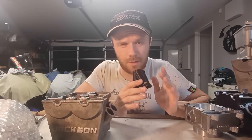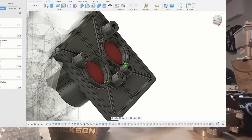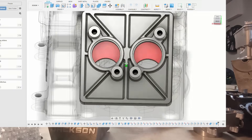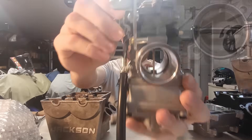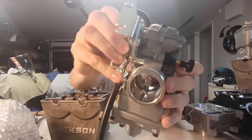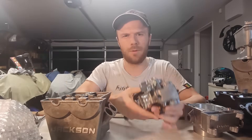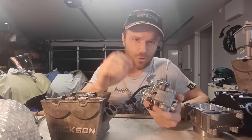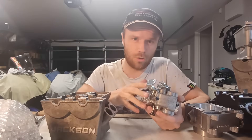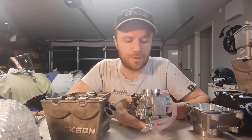While designing this I whipped up a quick design for a guillotine or slide throttle body that would mount straight on with a couple of countersunk bolts. The slide moving up and down would make it completely unobstructed at wide-open throttle, which is really good. If you look through the throat of a normal carburetor at wide-open throttle, you can see the needle in the middle and all these grooves and things along the sides. I think they affect power. If it's a straight, smooth shot through with no ridges or hollows at wide-open throttle — that's where we want the power. At 20% throttle, don't really care; at 100% throttle, that's where it's important.